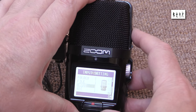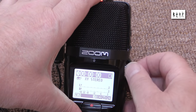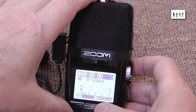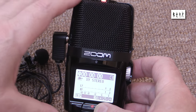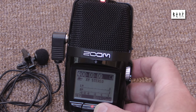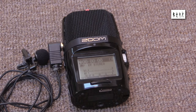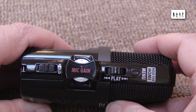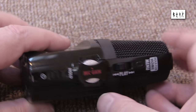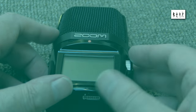I'm not sure that the internal plus external microphone combination is going to be a lot of use in practice. There aren't many situations where the recorder can be placed to capture general room sounds at the same time as having a spot microphone plugged into it, especially as a recordist may be operating a video camera several metres away. A further impediment is that there is only one single gain control knob, effectively ganged across all four inputs.